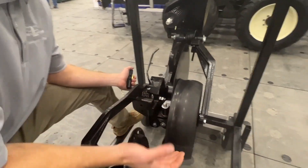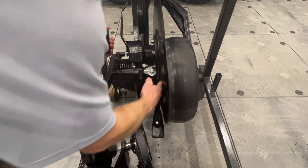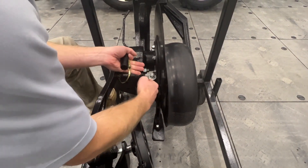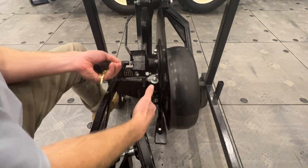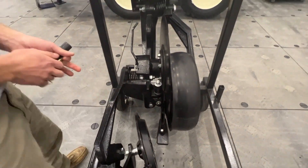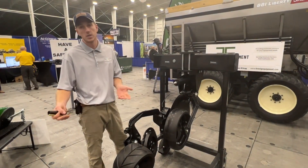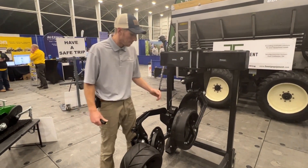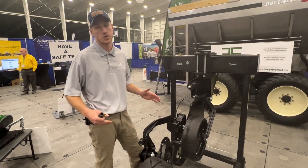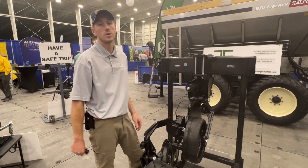The last thing we're going to talk about is the three-piece knife option. This knife is rubbing against the blade — that is what separates the dirt and soil from the blade to allow the anhydrous to get in there. The knife sits right in here, and then you've got your beaver tail. When you're talking high-speed, low-disturbance units, you've got wear parts much like on a mole knife bar. This beaver tail is going to be your number one wear point — it's doing all the work, spreading the dirt apart so the anhydrous can get down into the soil.